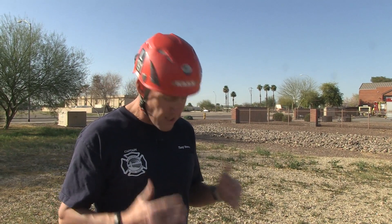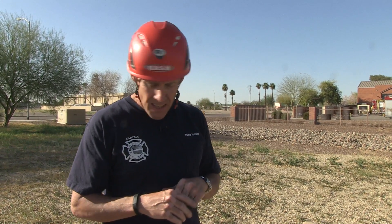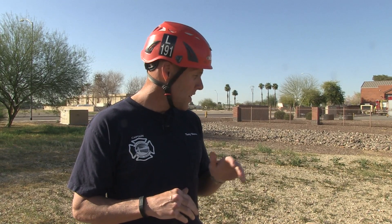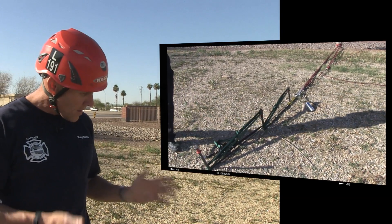The strength of the system is going to depend on the type of soil you're in. If you're in class A soil with a high clay content, the system will be stronger. You won't get as much force capacity in type C sandy soil that's been pre-disturbed. Today we set this system up in soil with some pretty good clay content, though it is previously disturbed — we're behind an old fire station that's been graded, so maybe class B soil. In our next video, we're going to put a load cell on it to show you the amount of force this system can take in about class B soil.